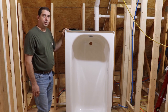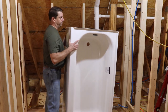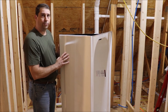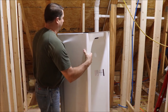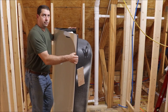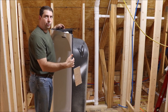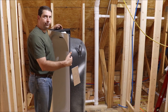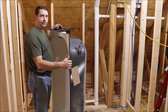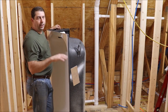It's a 16-inch deep steel porcelain-lined tub. On the front side of the tub, you've got a finished metal flange that comes down and rests on the floor to support the weight of the tub. On the back of the tub you've got this metal flange, so where it butts up to the wall you just attach a support board that this metal flange can rest on top of. Once the tub can rest on the flange and the front skirt and be level, you pull your tub back out of the opening and you mix up a mud bed.